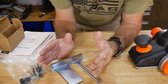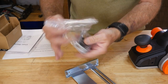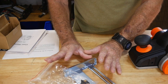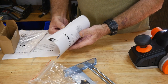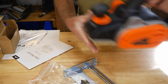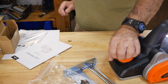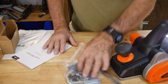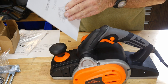The accessories that come with the planer include the guide. I'm not huge on these, but I have had to use them — it's a specialty kind of cut where you need to guide the planer along a certain edge. What I love about this particular planer is this control knob — you can dial it in once you feel the right depth of cut per pass. These electric planers are a time saver — one or two passes is a lot — and the finish you can achieve is pretty amazing.